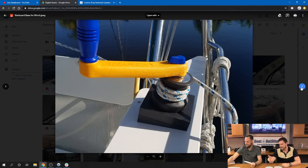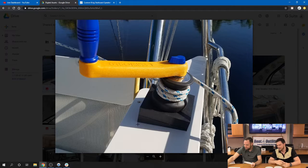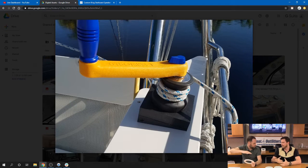Okay, so this is pretty cool. There are two things going on here. You have an angled wedge at the bottom, and then a piece of cut-to-size StarBoard on top to help build out thickness, so that when they were mounting this crank, it wouldn't be crooked. They also built out the thickness so they could get it better in line with the railing that the rope is running over. So it's not wrapping over it; it's actually just coming down and making contact around it, so your crank doesn't hit the rail. Exactly, the crank doesn't hit the rail.